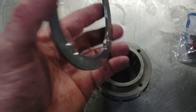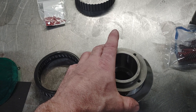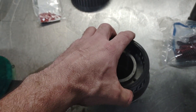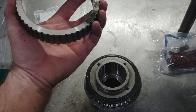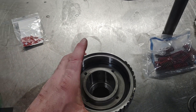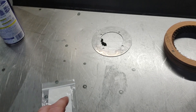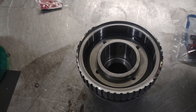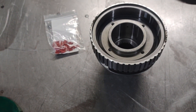The sprag shaft goes together. You've got this front retaining plate that goes on there and clocks into its direction. The sprag goes on — we'll check the direction of rotation after we assemble it. Then your sprag race goes on. The rear plate goes on and it comes with little screws that I will lock-tite into these holes and tighten. I'm going to assemble that and show it once it's assembled and check the sprag rotation on video.